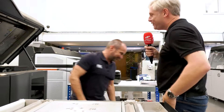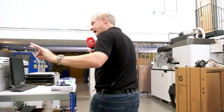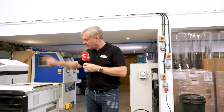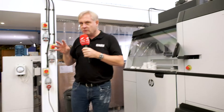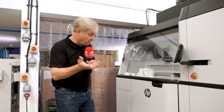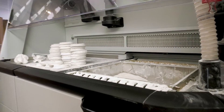And that's it. You let it cool and get it out - nice and simple. So not 3D printing like an inkjet, not like a laser. Great technology from HP - no over-melt. So you're getting flexibility, rigidity, quality. You've got your parts in another build unit. Around 168-169 degrees - it is hot, it needs to cool. It's going to print for 8 to 10 to 12 hours depending on application. It needs to cool - that could take two days. That's why they've got so many different build units here.